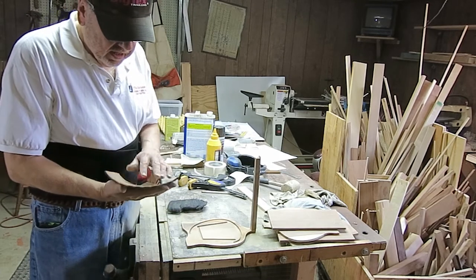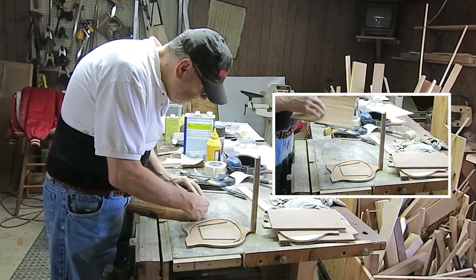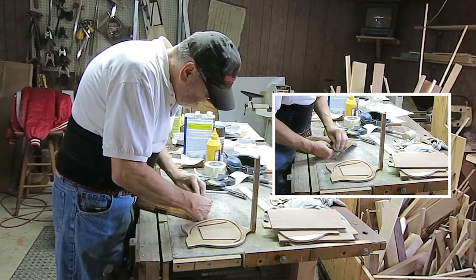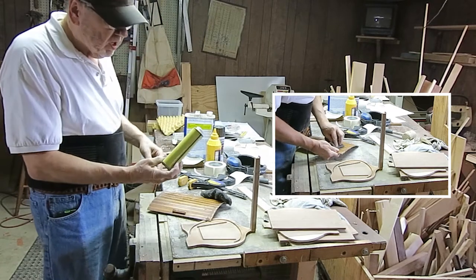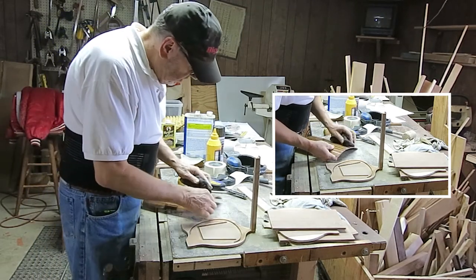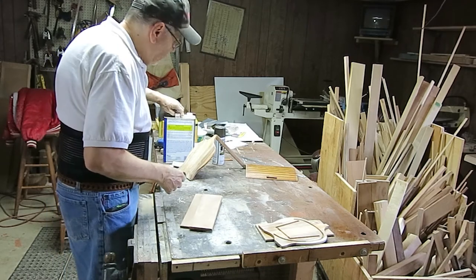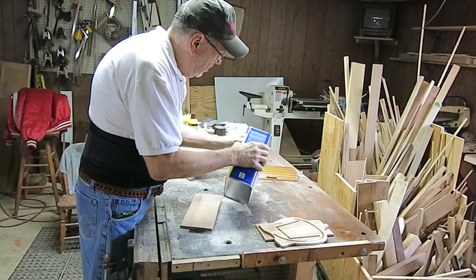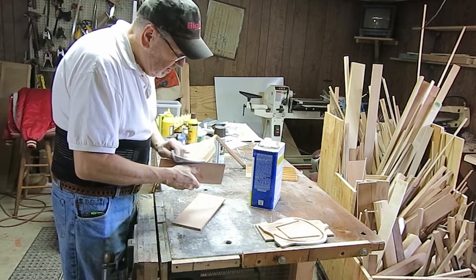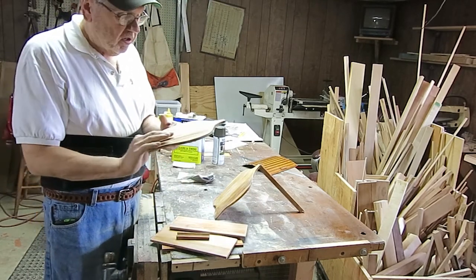I've block sanded everything with 220. All that's left is the roll top, and I don't want to do any more to it than I have to because of the cloth underneath — anything I might do might rot it. So I just want to clean it up a little bit with steel wool and get some gunk around the edges. Then I think I'll use restore and finish, very dry when I put it on there, because I don't want it to soak down into that cloth. Anything that goes down in there will tend to rot that cloth. Now I'm going to wipe everything down with mineral spirits to get all the dust off.